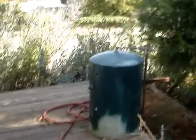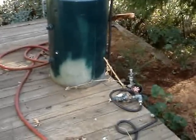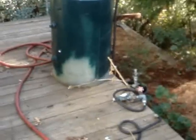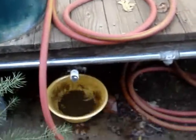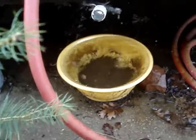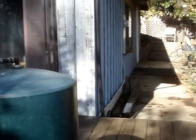Here's the old solar hot water tank — my free summer hot water tank. I've just taken it apart. It's November and I'm getting ready to leave the country till May. That's a leak, I'll have to fix that. Taking everything apart, and I'm going to run the lines now straight back, three-quarter inch when I get back.